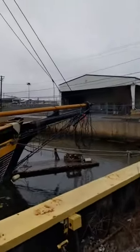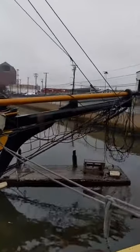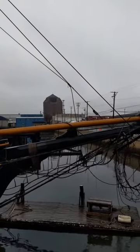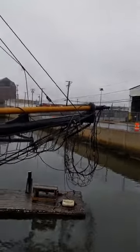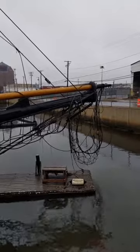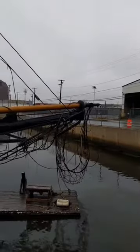This is also the first rain after the cover has been off, so things are a little leaky down below — not horrible, but everything's swelling back up. Taking a look from the side here, you can see how much rigging goes out with this jibboom. Right there — that's the heel block. The heel of the jibboom will eventually make its way all the way out to that block and set in there, and while that's happening we sort through all the rigging currently hanging off the end and get it all set into place.